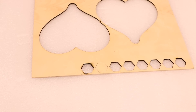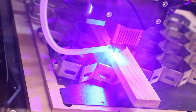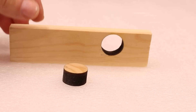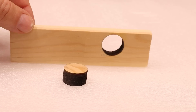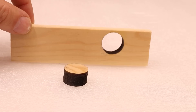It's exactly what we want from cutting thin material. So we've got a piece of 12mm plywood on there. We're going to try to do this in eight cuts at 250 millimeters per minute at 100% power and see if we can penetrate all the way through. We cut this out really clean — it probably did one or two too many passes because the piece had already fallen out before we got to the end. But it's nice to see that it can cut through this thickness of material.